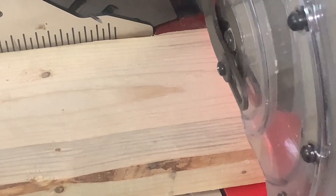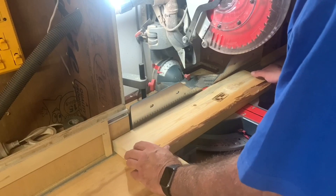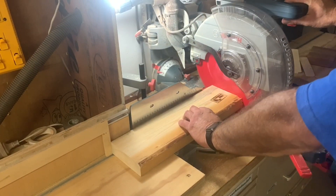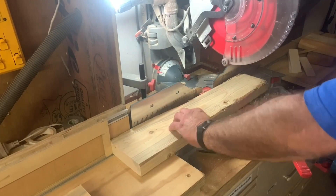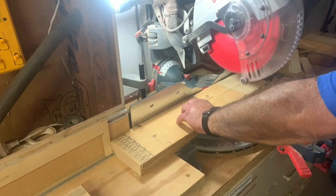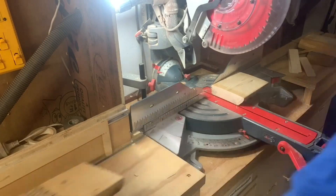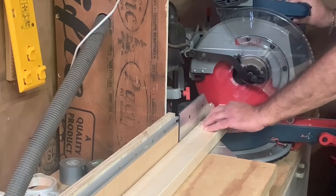The splay angle I've nominated is about eight degrees, and once these are standing up in the frame you'll find that the gap is approximately 800 millimeters at the bottom, which was sufficient in determining where I was going to put this in the house.